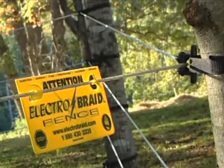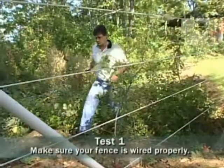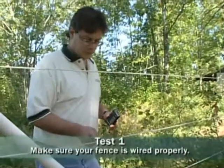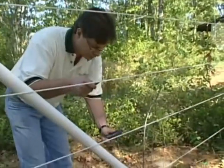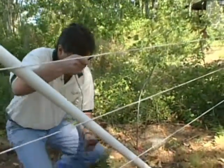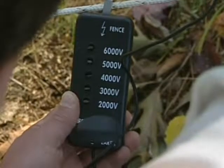To see if your fence is properly electrified, perform the following tests. Go to the furthest point of your fence from the ground system. Test the second from the top grounded line and each of the other electrified fence lines to confirm that the fence is wired properly with no electrical shorts. The voltmeter should read at least 5,000 volts.